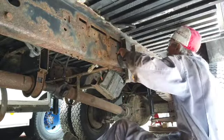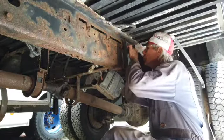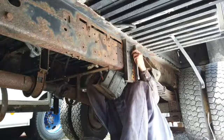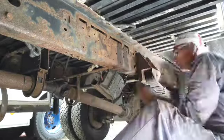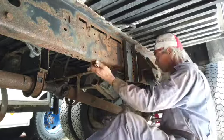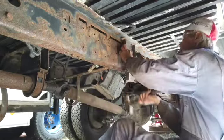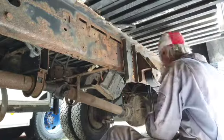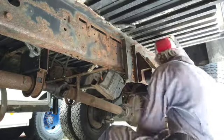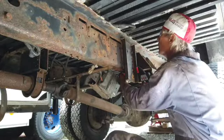And then I'm also dealing with two different elevations on the surface. I would have to weld down the shim plate. I would have to weld to my body frame, or cut away some of the body frame and weld directly to the chassis frame. I don't like chassis frame welding. It's not a good idea. It's just not prudent. So I don't agree with the idea of welding these on the frame of the drivetrain. I don't think that's the way to go.